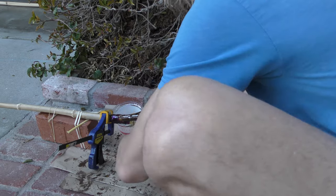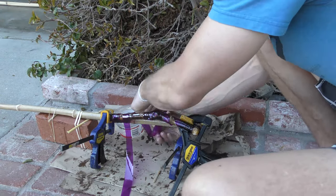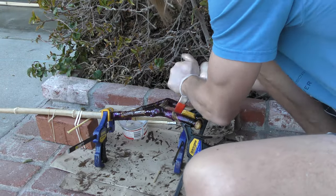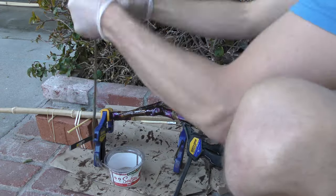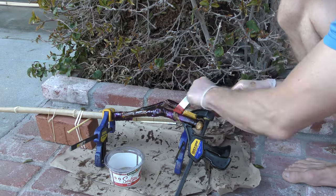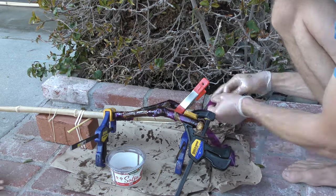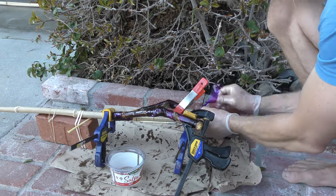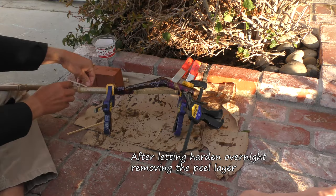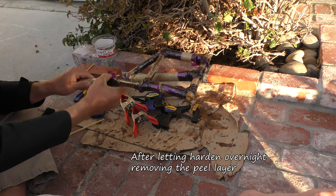Wrapping the joints with hemp adds a really durable layer. I've tried ways without the hemp and the joints would bust pretty quick — not very strong. The key with the wraps and the hemp is to make sure that the outer layer on the bamboo is removed. Once that's removed it opens up a porous layer and the epoxy and the wrap really adhere well to it. I have yet to have the joints fail since I've been building them that way.